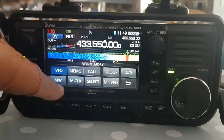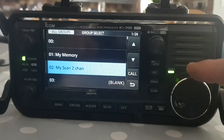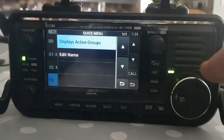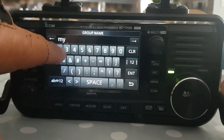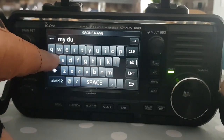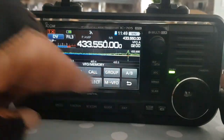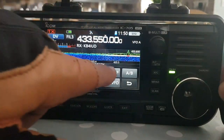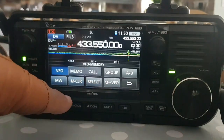Do the DR one first - the DR everything's in as I just showed you, and you want to get it into a memory. Tap the VFO button here, and first thing is choose a group. I've called this group 'My Channel to Scan.' Just go to group number three which hasn't been created yet, hold your finger on it, then edit the name - we'll call it 'My Dual.' Enter. You've created the group, and now just tap VFO, tap Group, select that group - scroll down to My Dual, tap it, and you're on that group.